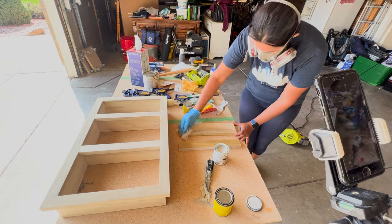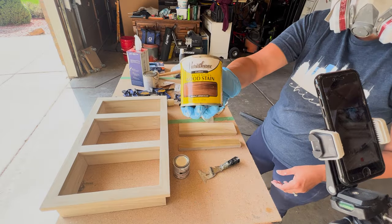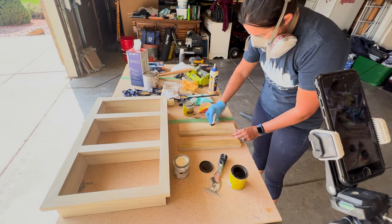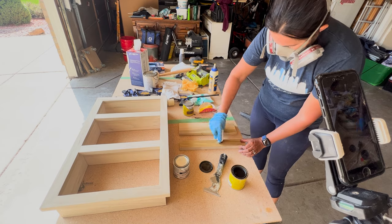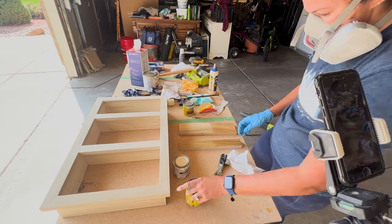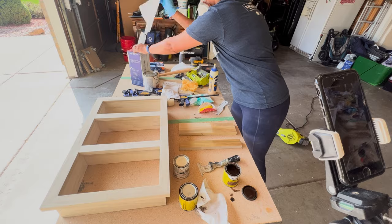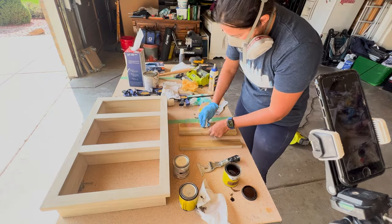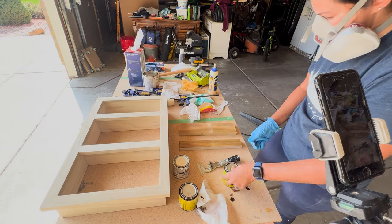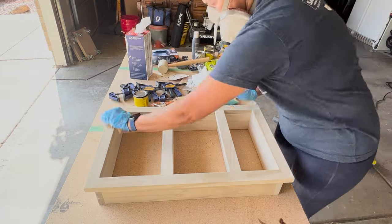Make sure that you wood condition first and wait about 30 minutes. On the right test piece, I did a white wash, and now I'm going to add my Early American stain. I immediately stain and then wipe off — I don't like it to sit on there very long; if I need it thicker, I'll just add a second coat. On the bottom is Early American, and then I'm going to add a little bit of Special Walnut to the tops. These are two of my favorite stains, but they come off so different depending on what wood you use. Once I took these inside and compared it to my tile, I decided to go ahead with Early American. So let's get to staining the entire piece.